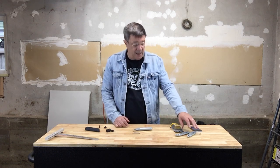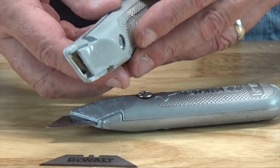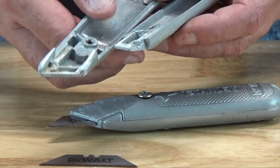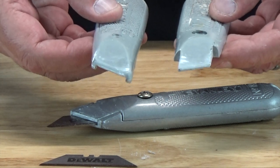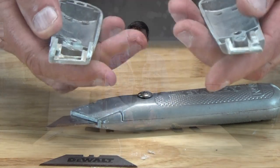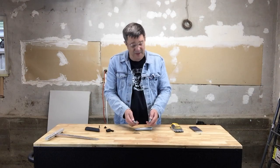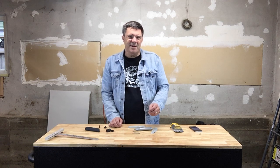The classic design is actually composed of two halves that are bolted together, and you might think that the seam would provide all the surface area you could possibly want for bed adhesion if you printed it upside down. Of course, you'd still need to provide for the knockout for the blade to rest in. The width and length of the blade don't play nice with the bridging limitations of most printers, particularly because the blade is actually pretty thin and the tolerances are fairly tight. So even if your printer can bridge the gap, it probably can't do it without some droop, which would be unacceptable.